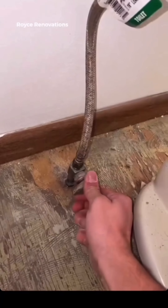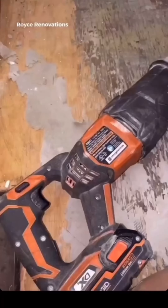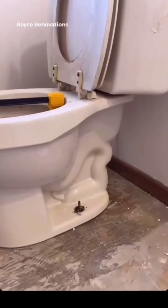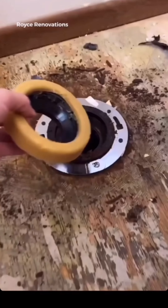Another daily tip. This toilet's leaking water on the floor, so that means we have to replace the wax ring. Start by shutting the water off and remove these nuts — but sometimes you can't just use a wrench; sometimes you've got to use a sawzall to cut them out. Now remove the supply line and lift the toilet off the wax ring. Clean off the old wax ring, put a new wax ring on, and reinstall. It's actually not a terrible job.